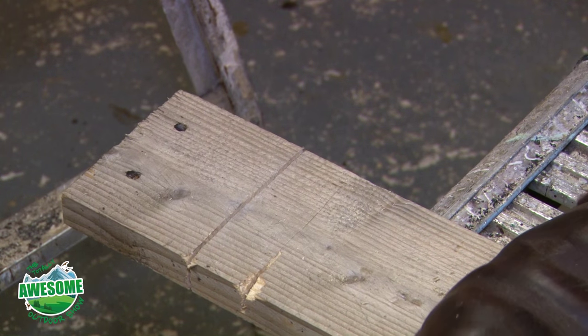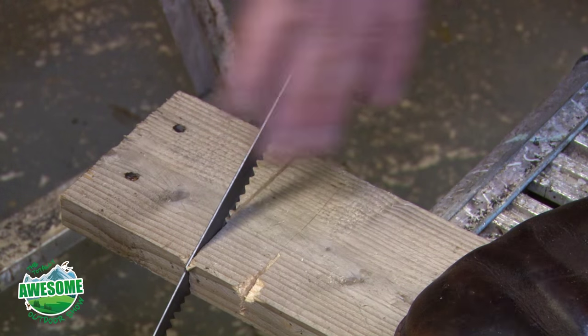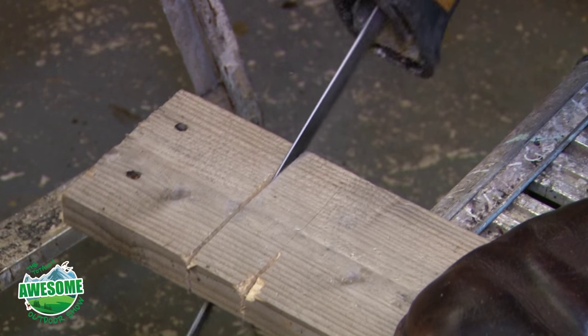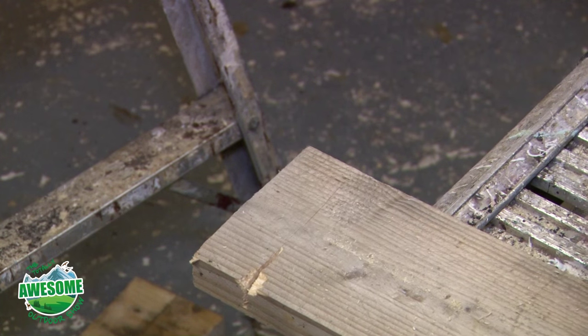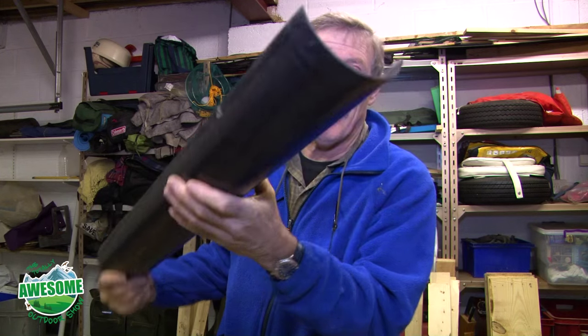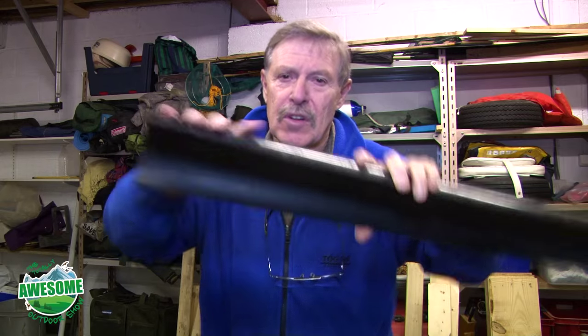That's a quick way of doing it. Now I'm going to make my channels for resting the bottle in from old pieces of guttering that I've washed and cleaned up, so it's nice and clean and ready to saw. I'm going to saw it, but it's very slippy with the saw — no chance with the reciprocal, it's going to be all over the place. Not so good with a hand saw either. You want a tenon saw, and I'm also going to put a little template to hold it — a little block of wood either side so it doesn't slip. It's plastic, so it's slippery.